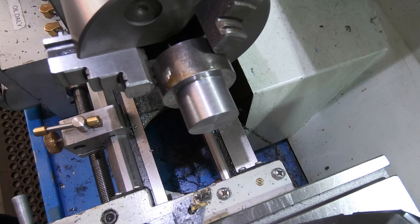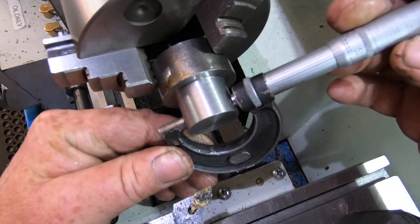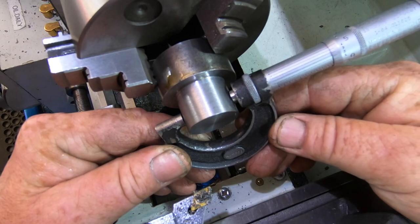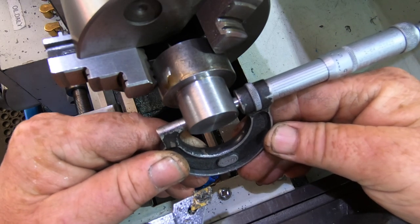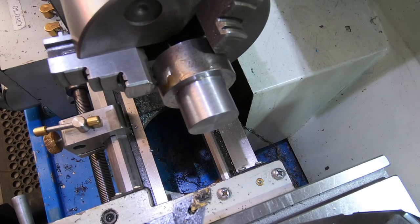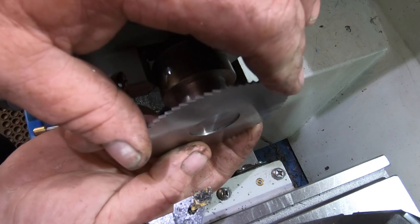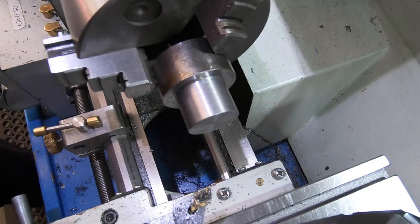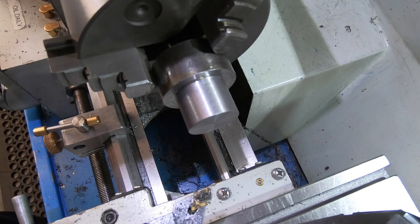Finish just quietly. Anyway, it'll be hidden. We're at 1 inch, 1 thou, and 5/10. So, I'm going to put that saw there. I'm just going to do a spring pass and see what happens. Not that you can take anything off, I don't think.